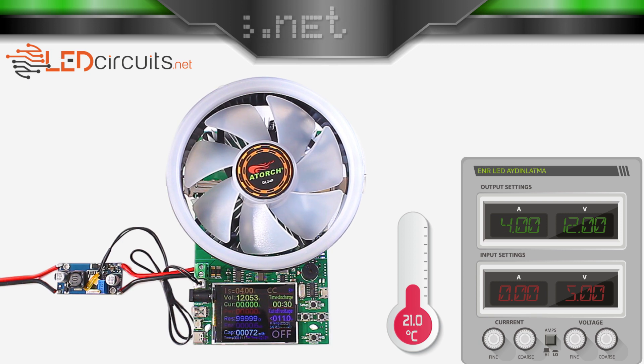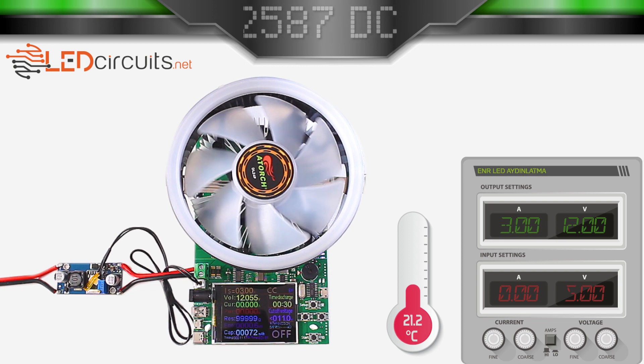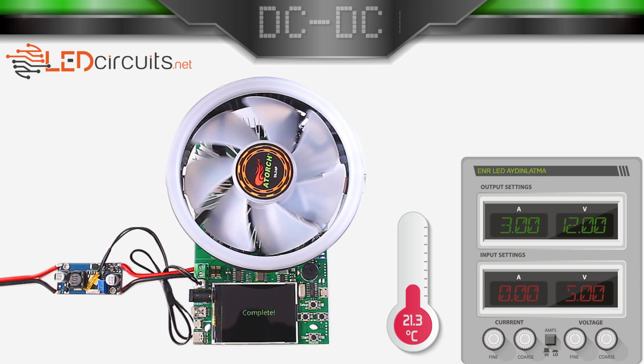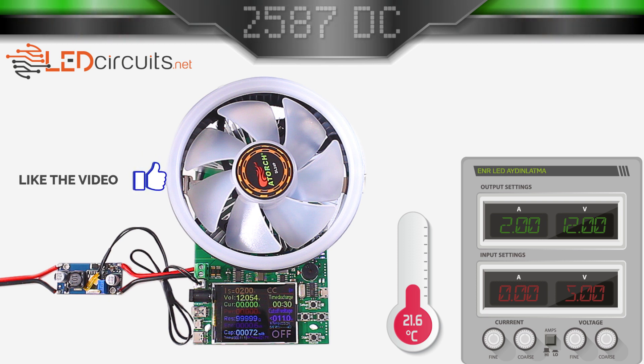Couldn't give current. Let's lower the current. It still failed to deliver the current. I want to make a statement here: when I disable the cutoff voltage — that is, set it to 0 volts — the power module and tester continue to work, but since the power module cannot meet the current I demand, the output voltage crashes. If I need 12 volts, with about 10% tolerance, I want it to work with 11 volts as the lower limit. Lower voltage won't work for me. I hope I've explained why I am using the cutoff voltage and why the tester keeps stopping.